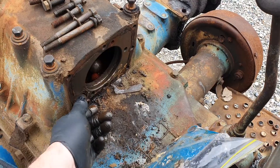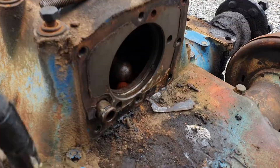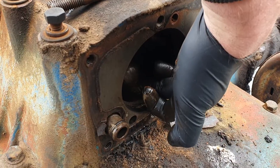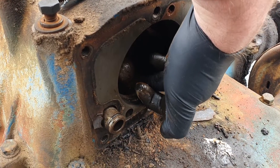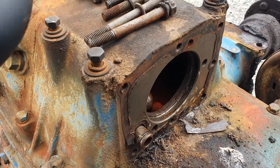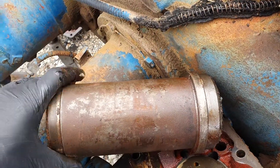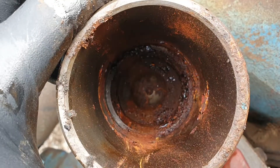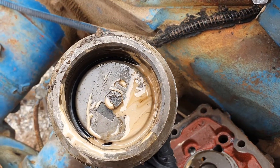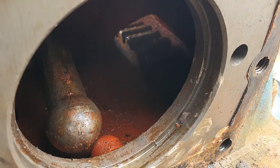We move that aside — it's very heavy duty. There's a little feeder pipe here, with an O-ring on either end to be replaced. If you have a look in here, you'll see a kind of ball on an arm. That's what goes inside the cylinder and provides that linkage to the lifting arms. The ball sits in that cup — it's very rusty. As the hydraulic oil goes in here and provides the force and push, it pushes that ball on the end of that shaft.